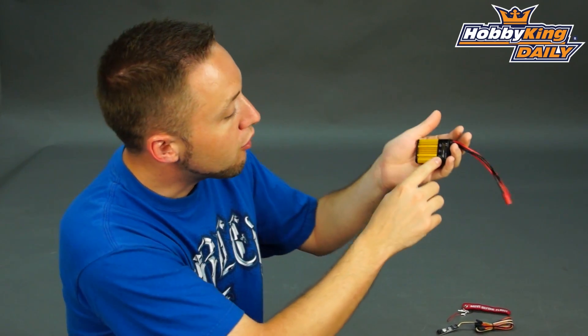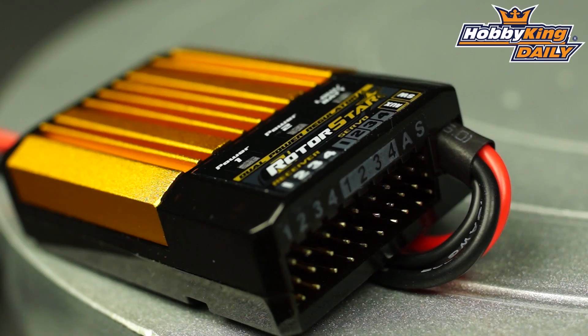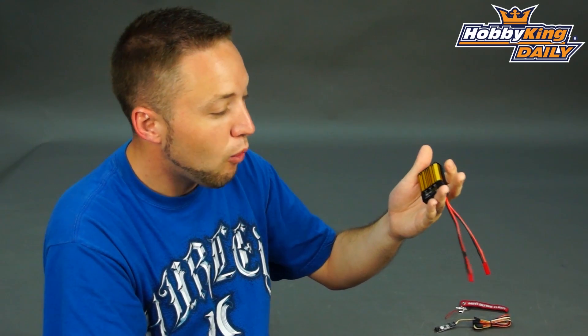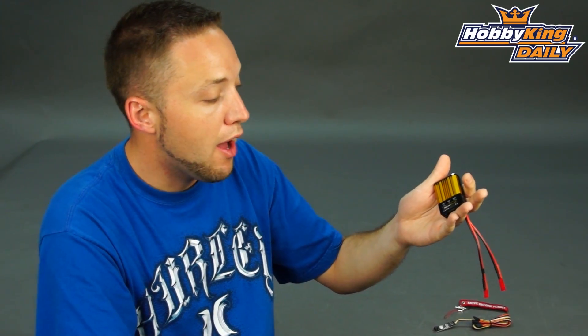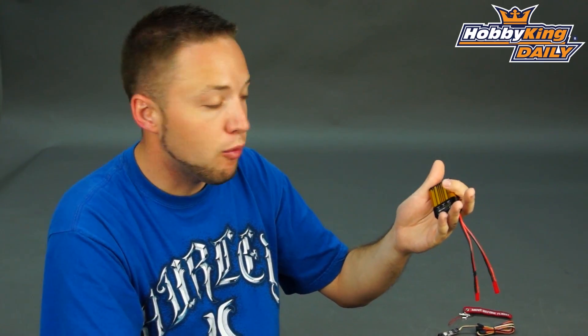This isolates the power from your receiver. You'll see here you've got inputs — one through four input, which will take the signal input from your receiver, and you've got direct outputs for up to four servos or any other electronic device that goes out directly to your servos. So all the power handling is done through this unit. It's quite powerful — this can handle up to 15 amps max current, rated at 6 volt, and your actual working current is 10 amps. Quite a powerful regulator.